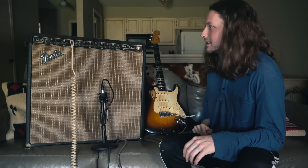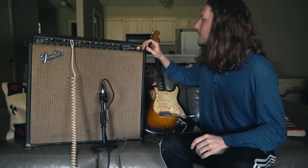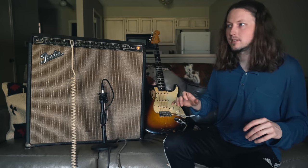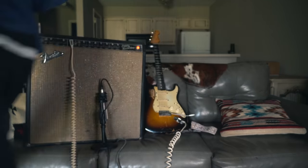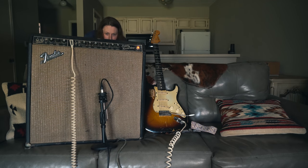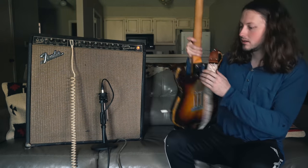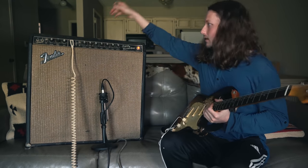All right, we got the light on. So that's a good sign. That's all we can ask for right now. Let me check the tubes and see if they are lighting up. Okay, so the RCA 6L6s have got power to them, and the GZ34, everything is lighting up and looking good. Nothing is looking really blue or discolored or anything like that. So the tubes are working. The original 60-year-old RCAs are working. I'm gonna flip the standby and see what happens here.